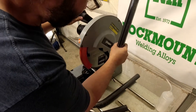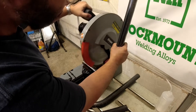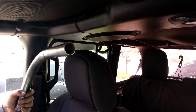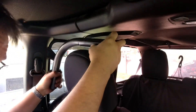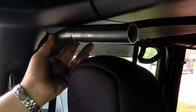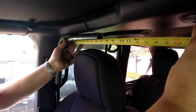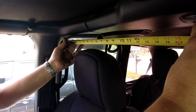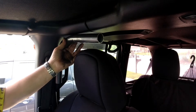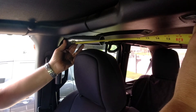I personally prefer the saw — I think it makes a better cut and it's by far easier to use. Just don't cut all the way through. Here's what that slot is used for: let's say I'm trying to figure out how long a piece I need — I can hold one of my standards in here, hook my tape measure up to it using that slot, and go over to the next spot. Or I can hook the tape in and go to the next location.